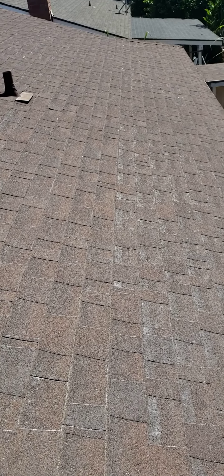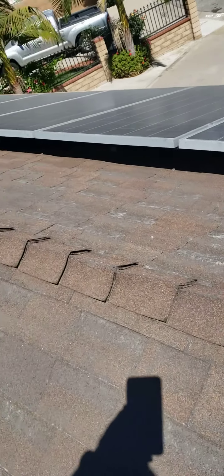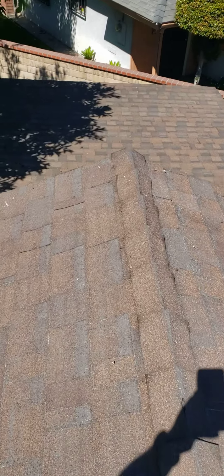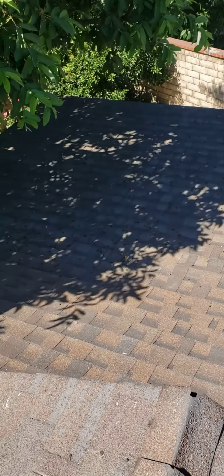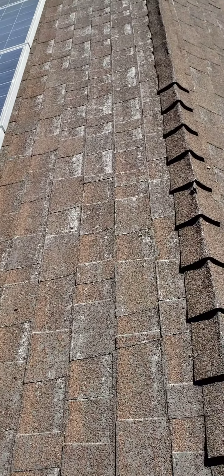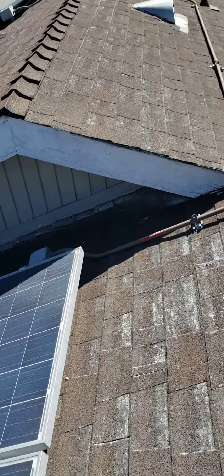This is the roof on Bryson. As you can see, it's peeling on all sides — it's definitely time to get another roof covering. This is kind of above the garage right here, and here's the side patio. If you look all along the edges as I'm walking here, you can see it looks white because the granules are already separating from the matted material.